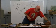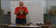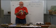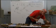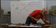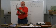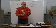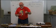And many jewellers prefer the ordinary, that's ordinary tool steel compared to high-speed steel. Many jewellers prefer these because they can actually manipulate the blade and bend them. For example, if I can find it, amongst all this stuff. But anyway, see how that's curved? They normally come straight. But I actually softened the steel, got it red hot, let it cool down slowly, and then bent it into that shape so I could go in and then come out, like I was describing earlier with the set.